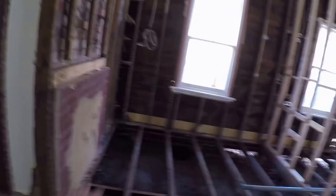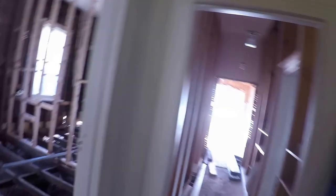You can also then put it on this chimney here and see if that's the same as the other chimney in another room, and so on so forth. You can move your level around to any room that way — to any part of this room here along the back wall or our load bearing points. This centre wall through here is also a load bearing point. We've got a major ridge running all the way through the centre of the house. So this wall and this wall have got a prop on both walls — you can see we've got a stump down there for a load bearing point, and another stump down in there.